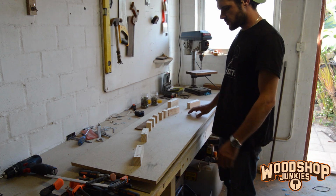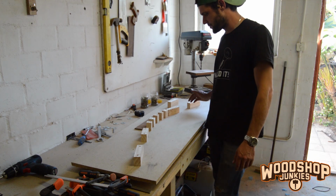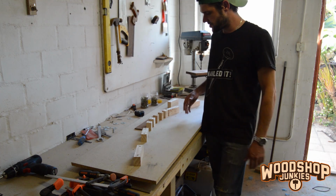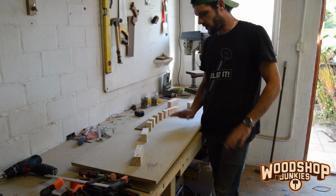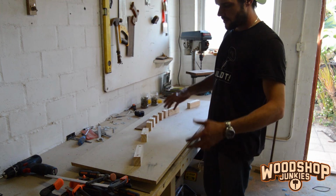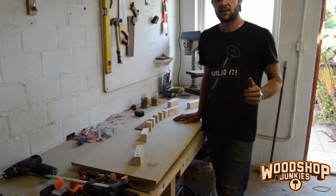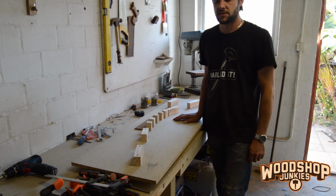Okay, great. So my small makeshift jig is finished. I'm not really bending the wood for anything specific, so I'm just going to try and get a curve on it. Ideally I would want to support the entire length of the wood I'm trying to bend by taking a solid piece of wood and cutting the curve I need with a bandsaw. But for now this will do. If I manage to bend the wood and I'm happy with the result, I will design a project that requires a curved wood and post a video on that. I've got about 10 minutes left before I can take the wood out of the steam box. We'll put it in the jig and see how it turns out.